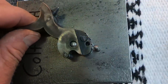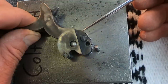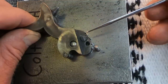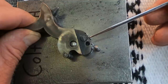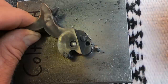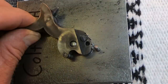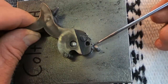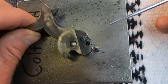Comparing the 38 Colt's hammer: the safe notch has been ground down quite a bit on top, slightly further back than factory, which is what lets the firing pin protrude. The load notch has been ground way back and doesn't have the overhang that keeps the sear from disengaging, so you can pull the trigger while in the load notch — and it's so far down that the bolt is still engaged in the cylinder and you can't rotate it to load. The full cock notch is cut where it's supposed to be and actually has positive engagement.